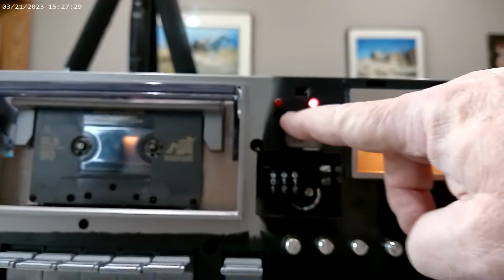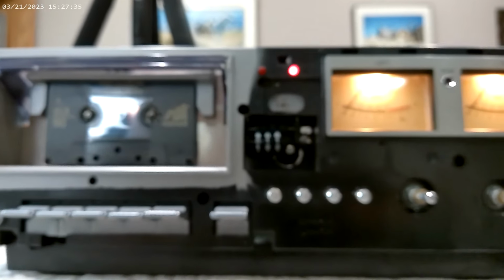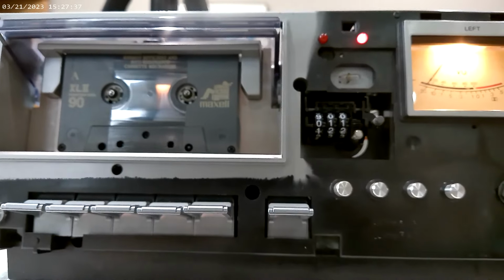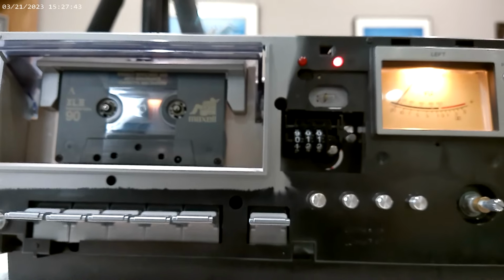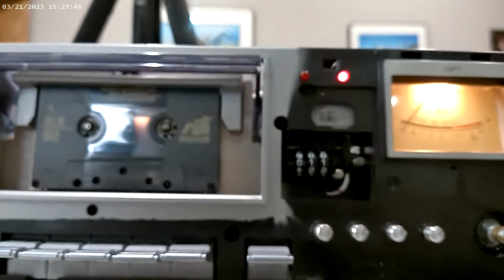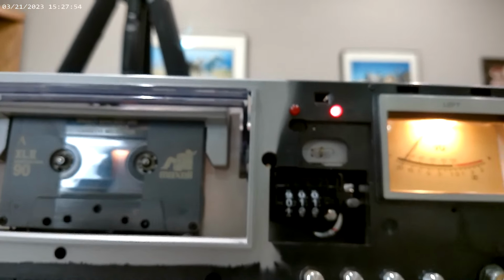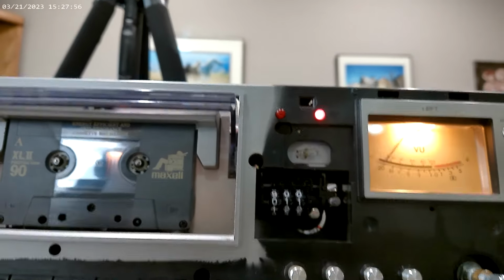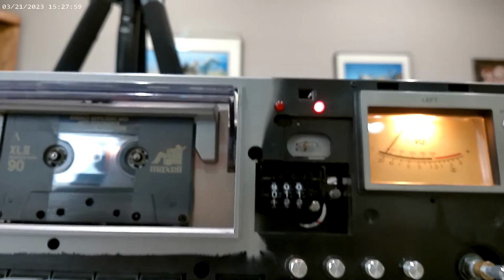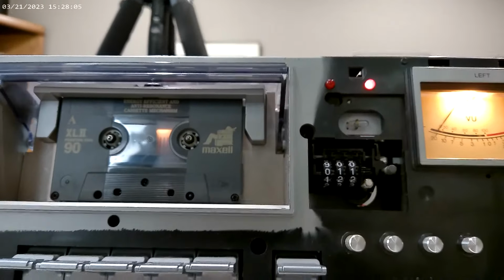Then my wife and I discovered that this little hole here, you can get in to adjust the speed as it's running. Okay, pro tip. How many think, write your comment, how many think to increase speed, you move it to the right? That's what I thought. Man, that would be wrong. To increase speed on this motor, it's left, like lefty-loosey. Found that out through trial and error.